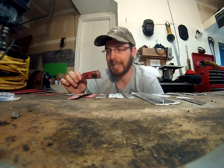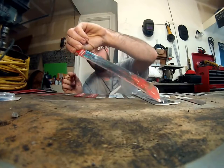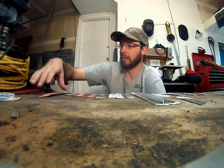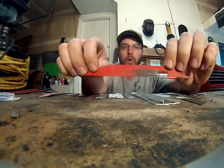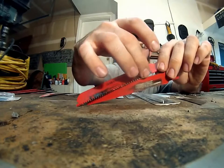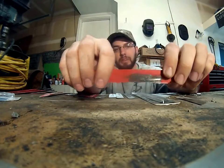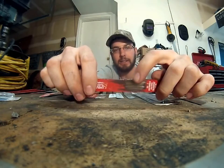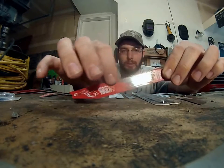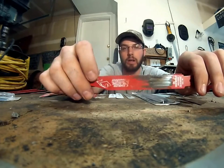However, getting it on a product, getting it to where we can use it properly seems to be the issue. These blades would last longer because the carbide is a grit than these, and that seemed to be the main problem, that the carbide would just shatter and shear off of there. And then of course this one right here, this thing did really well right up until, because this one is a solid strip, and these have individual pieces of carbide brazed onto each tooth. When this flexes, it doesn't affect the cutting edge. However, when this one got hot, you can see it got hot right here, the metal backing it flexed. And when it flexed, because it's one solid piece of carbide with little teeth in it instead of the individual chunks, that's when this blade broke down and failed. So when you see this one at the store, keep that in mind.